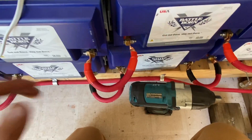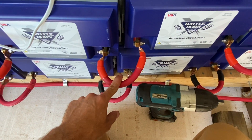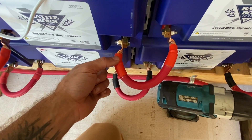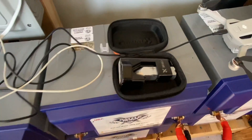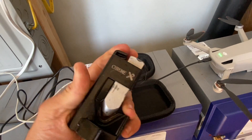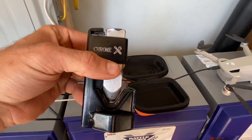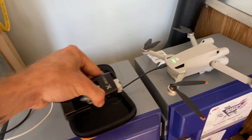For the connections, I cut eight-inch pieces of 2/0 welding wire, which is a bit over-spec for what I needed, but we had it laying around — my dad had a whole spool of it. I bought some 2/0 connectors, which have a little open end on one side and a bolt-through end on the other. I cut the wires and crimped them down using a crimp tool I bought on Amazon for about 12 bucks. You just put the crimp inside with the wire and hit it with a hammer on concrete. I wouldn't say it's the best quality tool, but it worked for my purposes.